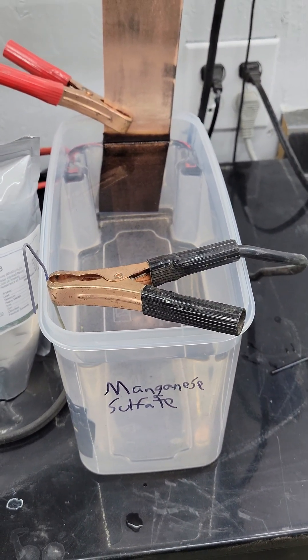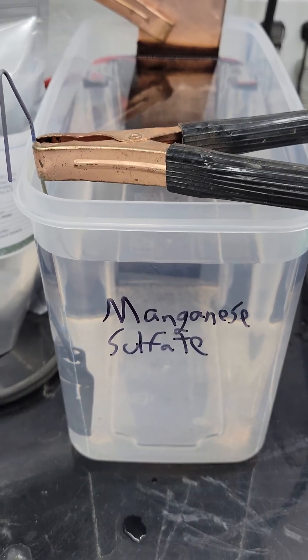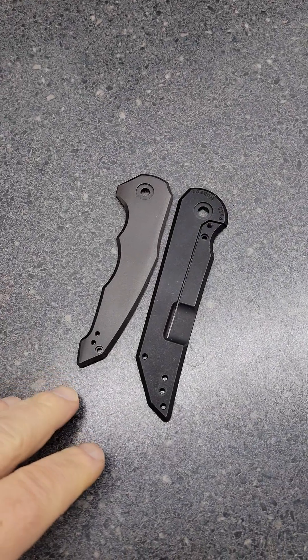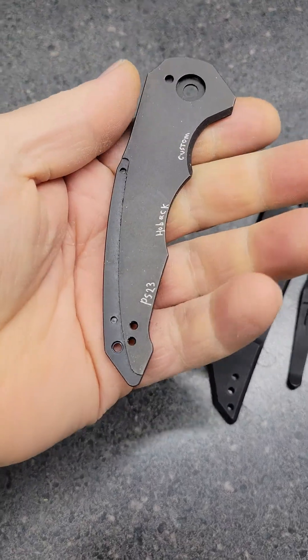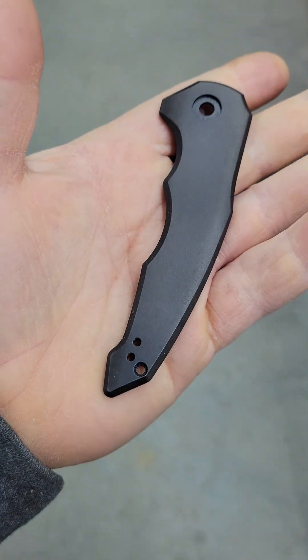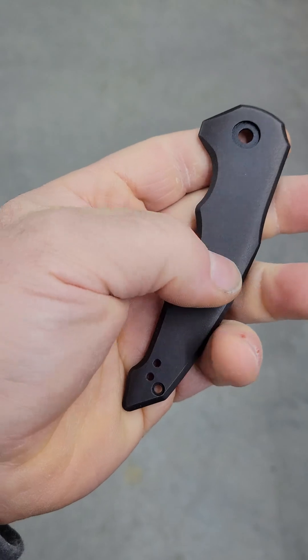I'll go over blackening, because that's the one everybody wants to know about and the one we recently discovered how to do. The whole trick is basically high voltage with manganese sulfate solution as your electrolyte. Base finish makes a difference on how black it gets — you can get gunmetal or you can get straight black. This Sam version two custom frame that I just finished is more of a gunmetal, and even though the lighting in here is somewhat harsh, it's very black — kind of like a dark charcoal.